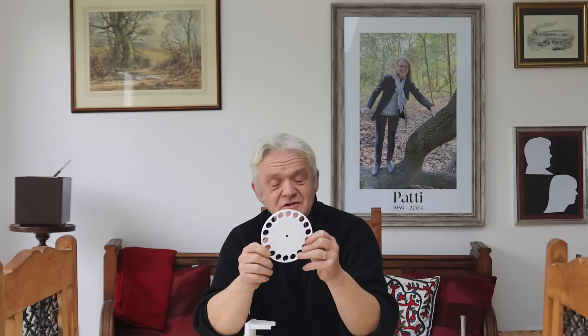Once we put those together and fix them to the frame, we should be able to rotate the magnets. The whole idea is that we're going to use both sides of the magnetic field without having to do anything else, making a very light generator that can be 3D printed and should in theory be pretty good. The holes you can see here take neodymium magnets - 5mm by 15mm - arranged north-south-north-south. We're going to wind the coils as serpentine coils using the serpentine coil winder I've done a separate video on.